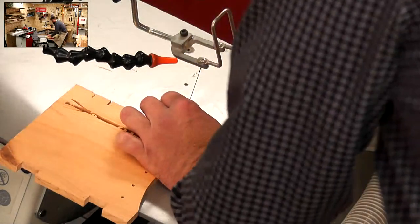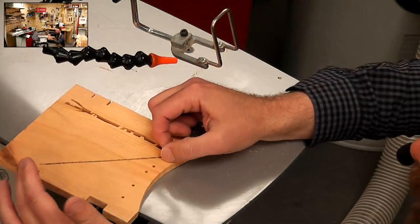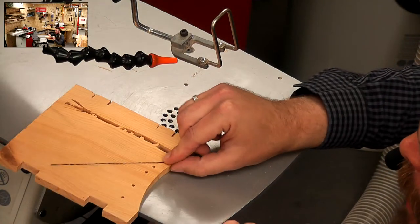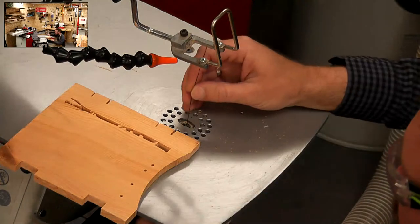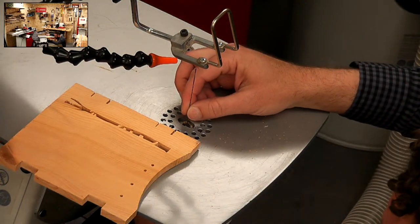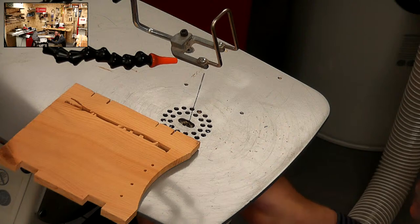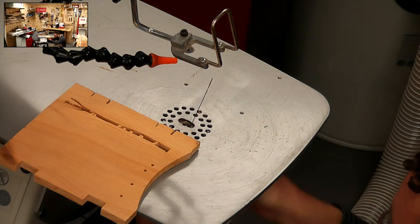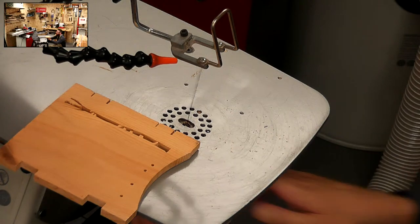So I'm fitting my spiral blade. Let's pop that on there. So this is like a blade that's just been twisted along the length, and I'm just feeling which direction the teeth are flowing. So if it grips when you're pulling a certain way, that's your teeth facing down, and that's the way the blade wants to go into the clamp here. So just pop that in, pushing it right the way back.